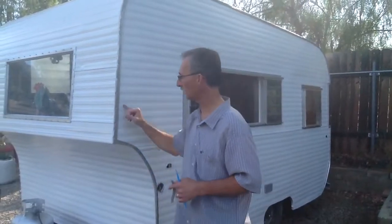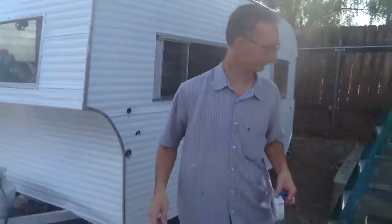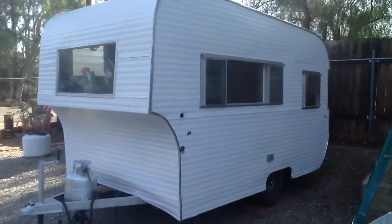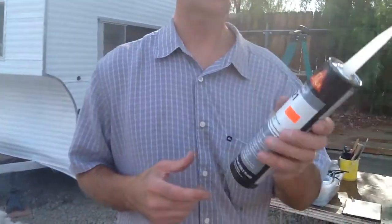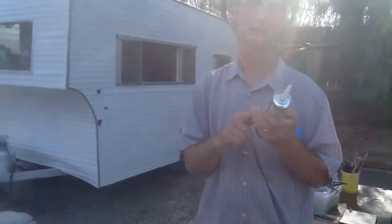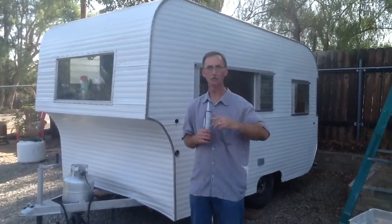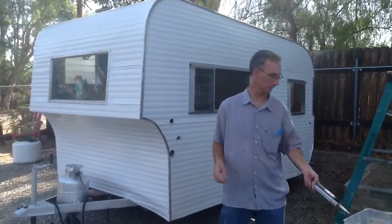The next thing I'm going to do is take the white silicone sealant and put it in this edge here and run it all through so it looks nice and pretty. Now the sealant — we got something a little different. This was recommended because you can work it with soap and water and it's very easy. As you can see, this is actually a polyurethane sealant. The nice thing about that is you can put it into your grooves and cracks, then take a soap and water mixture and use your finger to actually smooth it right in, so you get a nice smooth bond instead of fingerprints and streak marks. This should make it look smooth and fill in all the extra spaces.